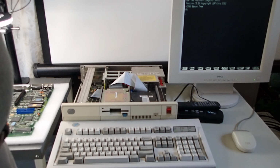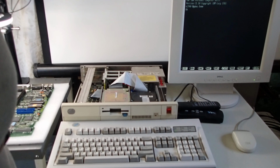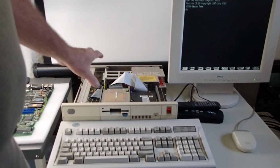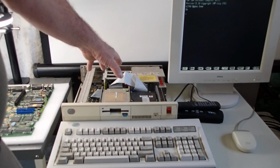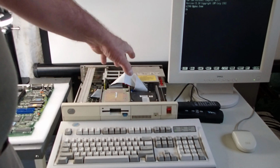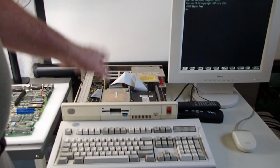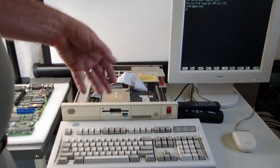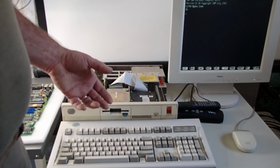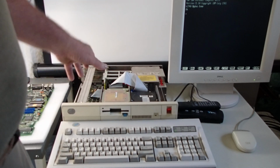They tried other units that were also new in box. They were able to get one unit out that had a skewed video, so there's other things going wrong with the MCGA controller. But they at least did get video out of one unit, but he was not able to gain further, mainly because he tried booting with a 1.44 megabyte diskette when those diskette drives, in this case, are 720 KB, and so it's the wrong diskette type for booting the machine. So he didn't get any further with that, and the video was a bust. I mean, he didn't fix it. He badly ruined one of the machines in this case, and the video didn't have any solution other than really just showing people what it looked like inside.